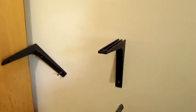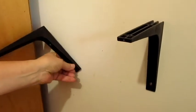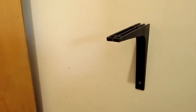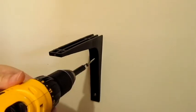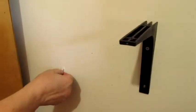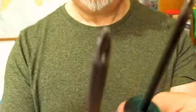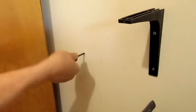That seems fairly level. So first thing I'm going to do is anchor this one in here. Then, to create the hole — this is going to be the anchor, and I need to have it a little bit bigger. So I'm going to use a Phillips screwdriver. I find that to put these anchors in, the Phillips screwdriver works really well. I have two kinds: the small one to create the initial hole, and then this one, as you can see, fits really well. So I'm going to go like this — there it is — and then with the bigger one.